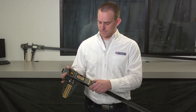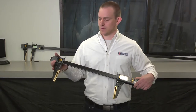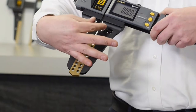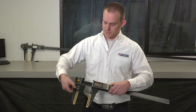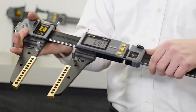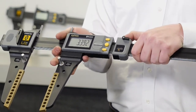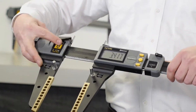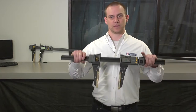This features a 15 inch up to 120 inch range, 8 inch deep jaws, which are titanium-nitride coated steel, as well as internal measuring pins in 8mm and 5mm sizes. These are removable or reconfigurable. It also features a force gauge for inside or outside measurement to take out error, as well as a movable left jaw for balancing the beam on large measurements.